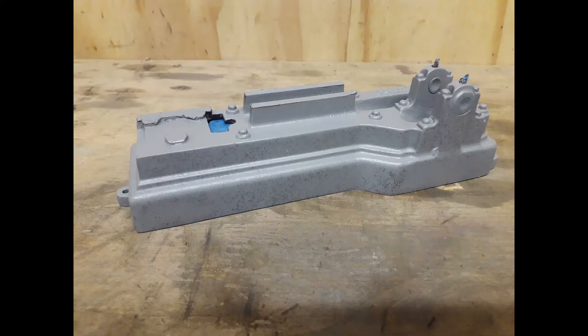We used screwed-up masking tape — someone also suggested a bit of cork which will work fine. You can see we've got it ready now with the etch primer. That's the first coat. If you can see it's a bit patchy, you don't want your first coat to go on heavily — just want it to go on ruffled so it grabs all the metal. While it's still a bit tacky, give it a second coat, let that one dry off, and then a third coat.